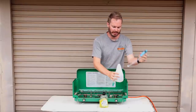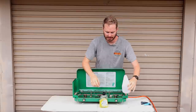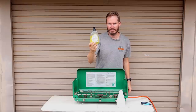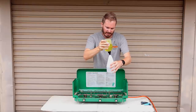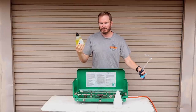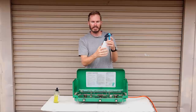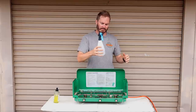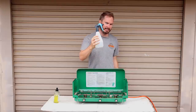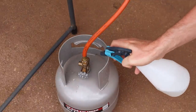So here I've got just a little trigger spray bottle — 400 ml of water, doesn't have to be exactly that, just enough to splash around — and Earth Choice Lemon Burst Dishwashing Liquid. Just going to make up a soapy bubbly mix. You may as well hang on to the soapy bubbly mix for actually cleaning up the stove, because no doubt it's covered in dirty cooking fats. Just give that a little bit of a swish around. And we're going to turn on the gas down at the bottle and start by spraying some of this mixture on this fitting.